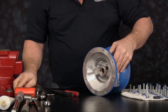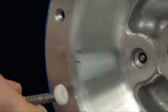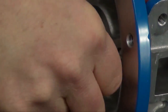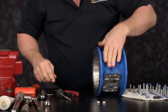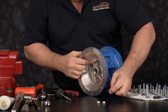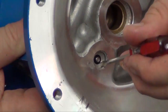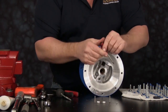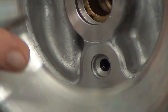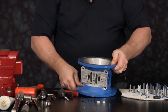By using a wood screw or a similar item, simply thread into the plunger pin bushing and pull out to remove. With a small screwdriver, remove the plunger pins and the plunger pin o-rings. The o-rings actually sit down in an o-ring groove, so be careful when removing them not to scratch the casting. Once these items are removed, we are now ready to install our new air-end kit.